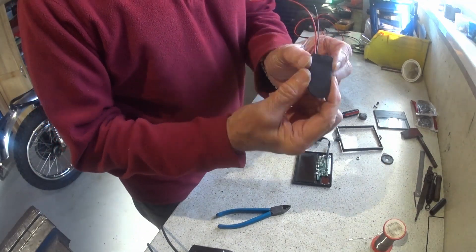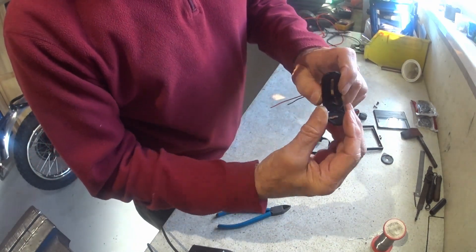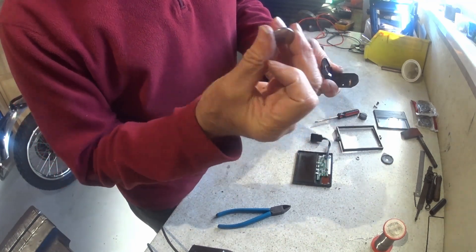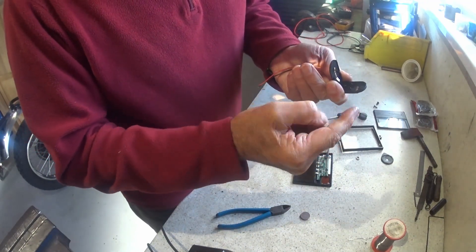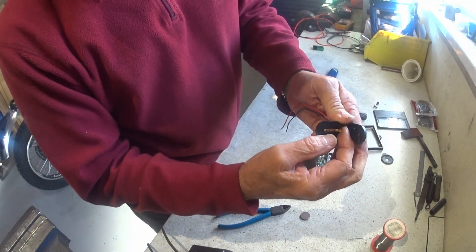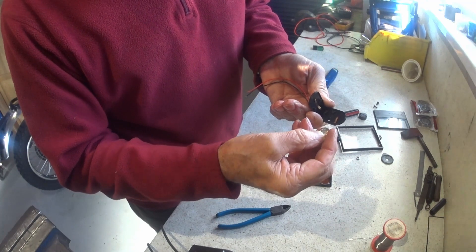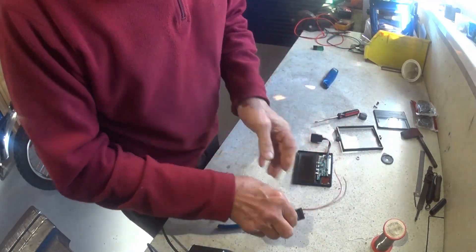So it wasn't a little LIR like a computer battery. You can buy these battery holders off eBay — these are six-volt ones — but what I've done is, this takes two CR2032s, which are the most common button cells. Because connecting them in series gives six volts and I only want three, I bent the inner tabs so they touch each other when you close the lid. Then if you put the battery in upside down it should give me three volts at the right polarity.